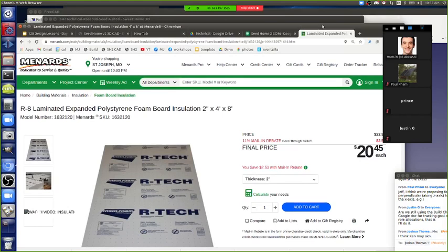If the requirement is whatever you got in your place, then you'd need to go to, instead of 2x6s, 2x8s or something like that, or do the same as we do and build out the walls by however many more inches, so that you're either expanding your foundation to keep the interior the same, or keeping the exterior the same and making your walls a little fatter towards the inside, so you have a little bit less space on the inside. So these are modifications that would have to be made.